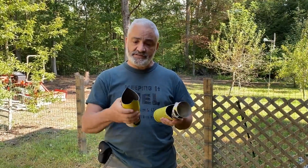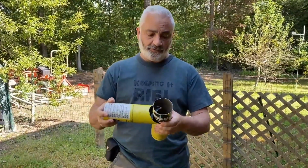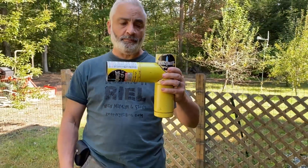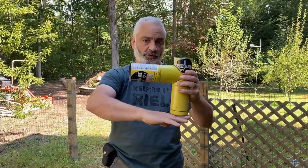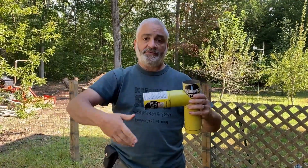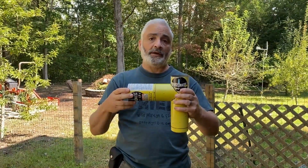Finished cutting the pieces. We have this piece here, which is going to be the air intake, and then this piece here, which is going to be our ash drop. And I cut these to fit together like that. And then this will be attached to the bottom of the wheel rim. So any ash that builds up will drop down, and we'll have a little door here to dump it. And our air will be blowing in here from the side, and that'll come up into the pot to help ignite and heat up the coal bed.